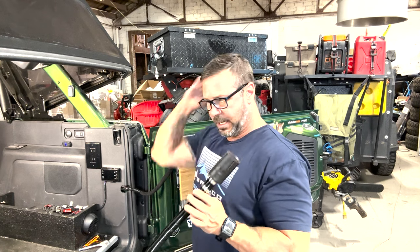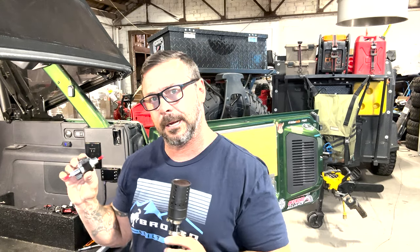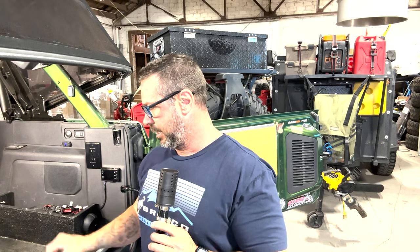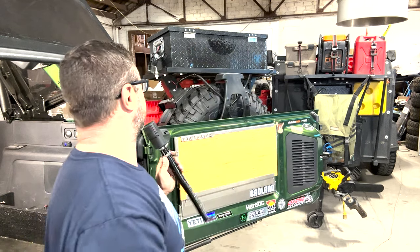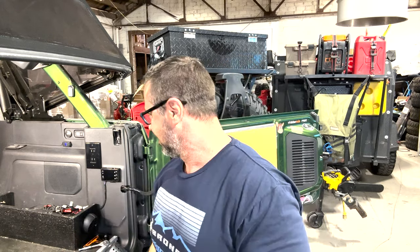The first thing I'm gonna do is the air intake, and then I'm gonna do the exhaust. And then after that, what we have to do is secure and install the fuel pump and wire it in. And then at that point in time, we need to figure out a place to locate the diesel tank, get some diesel in it, and start priming the fuel pump to bring diesel up to the actual heater, and then go ahead and test it. So I'm kind of excited, we're not that far away. Hey, diesel heater. Okay, let's go.